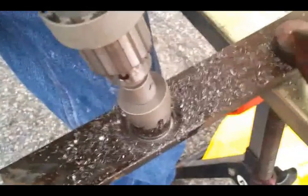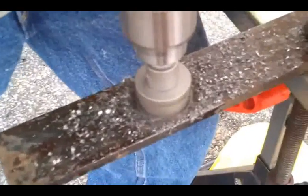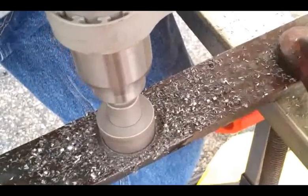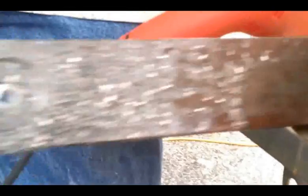As you can see, it's a deep hole. We have a little bit more to go. We're going to check how deep we are — I think we've bottomed out. We're going to finish this cut from the other side of the material. These come in three different depths. We went through a big piece of steel, but it's making short work of this. If this is the cutter that you have, you can reverse the mark, go through on the same pilot, and you'll make short work of the cut.